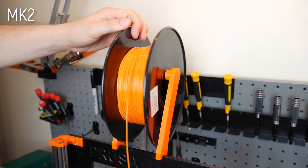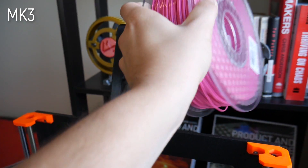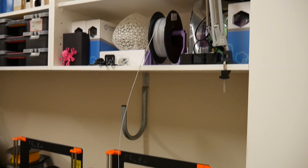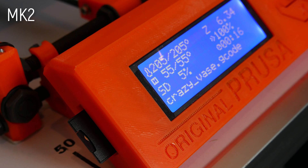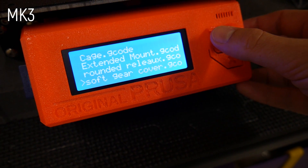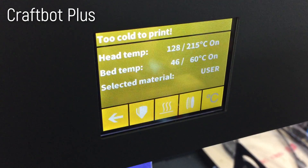The Prusa team also finally did away with that horrible spool holder design with two pieces, opting for a much simpler large one-piece design. Personally, I don't like mounting spools to the top of i3 designs at all — I much prefer a separate holder mounted next to or above the machine. The firmware for the Mark III is much improved over the Mark II and has been revised many times since I've had it, but the interface remains unchanged: it's still the old school click wheel with the blue LCD. I would much prefer a nice little touch screen like we're seeing some other printer manufacturers moving to these days.